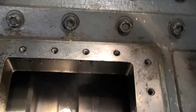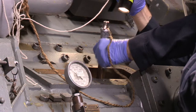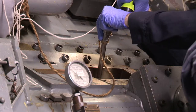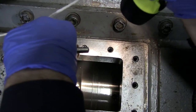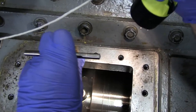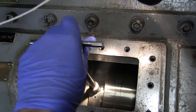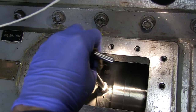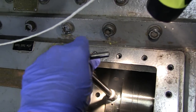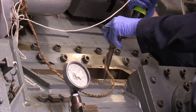You can see the four teeth on the fitting and the four teeth on the tool - we're going to sync those up. It goes on the first set, then you press down to engage the second set of teeth. All of our tools and flashlight are lanyarded off. It goes on that first set, then a slight twist and you push in to fully engage it. You can feel the spring pressure - when you twist it and push down, that's what locks you in. To turn it you have to maintain a little bit of pressure to keep it from backing up; if you only go to the first set it'll just spin on the tip of the fitting.